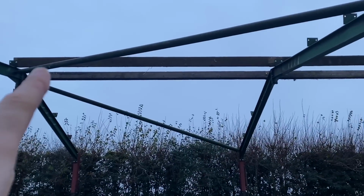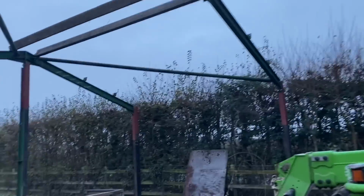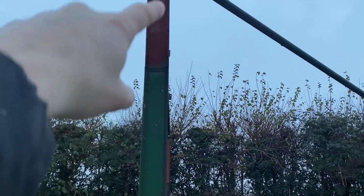And then we've started off putting the timbers back in the roof. We've got the top ridgeline ones on. And then once we'd done that and we knew where everything needed to be, because they're the original ones, so the spacing was correct, we've then gone on and put this extension on, which is bolted at the top, welded in the middle. Adam's just come in this morning with some plates that we're going to weld a plate either side to just strengthen that a little bit.